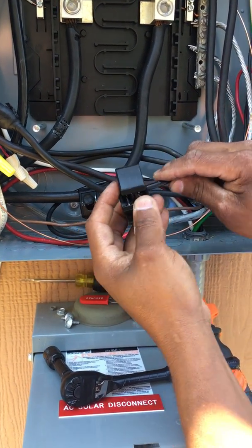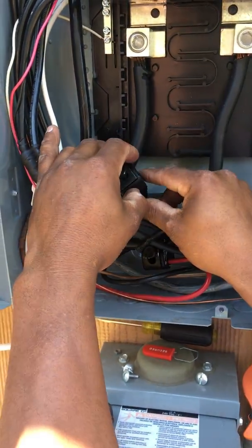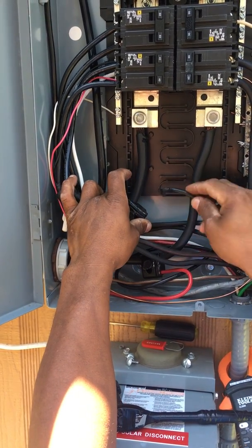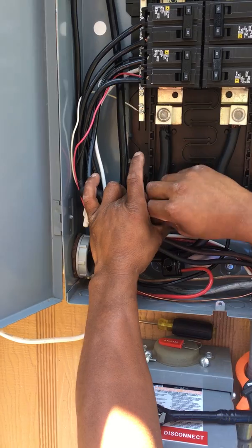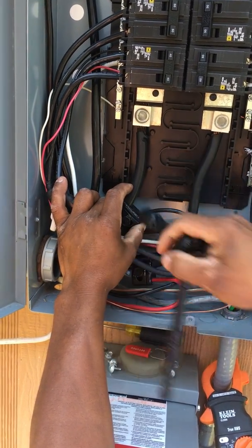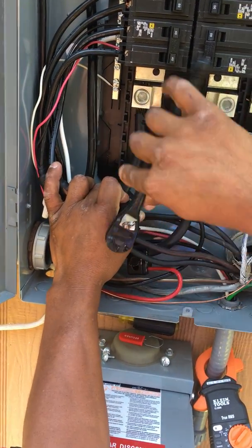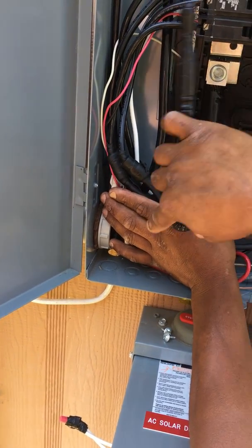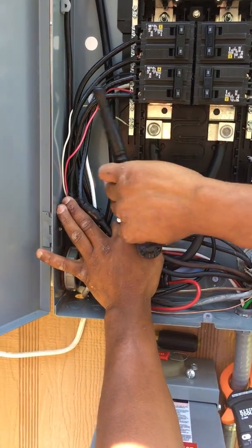Something went in my eye. You put the wire on here first and then you turn it. Take this off first — make sure you've got it nice and loose. Put this right here and be very careful where your fingers are. Stick it back in the hole and twist it — this is not hot, but all of this is insulated, so you still want to treat it as hot. Hold the wire nice and tight, watch where this end is, get it all the way down — be careful where your hands are. Now straighten this part out and make sure it's correctly aligned — you don't want it hanging off the edge. Hold it tight so you don't shake the bus.